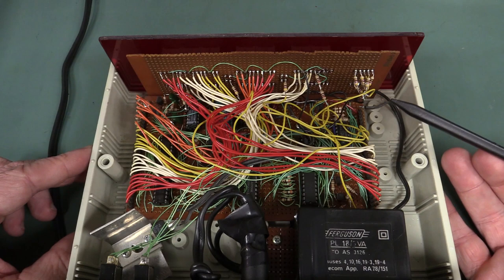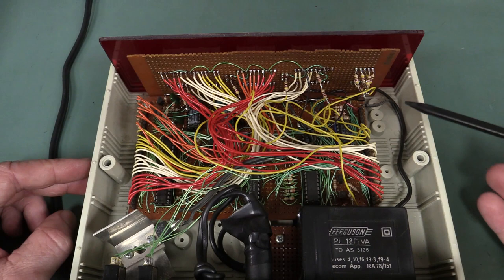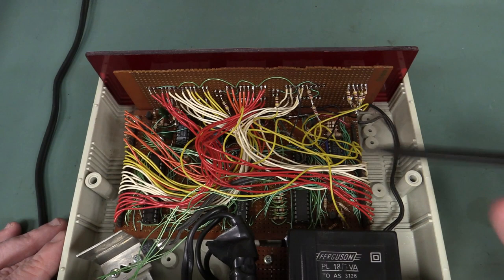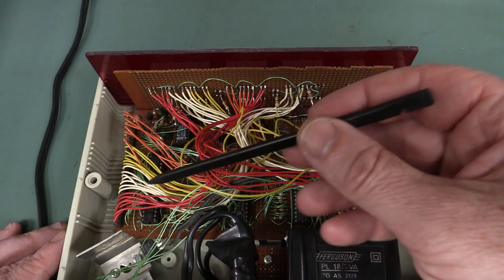Back in the 1980s there were no microcontrollers that you take for granted these days. So this is all done with discrete TTL type chips — I use the term TTL generically. These aren't actually 7400 series TTL, they're actually 4000 series CMOS. I'm pretty sure all of them are actually 4000 series CMOS. I just hacked it together on a weekend using some Veroboard or point-to-point wiring.